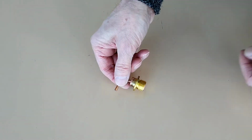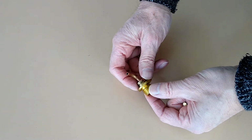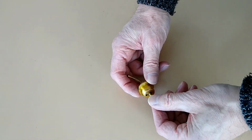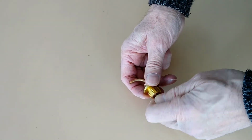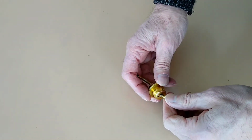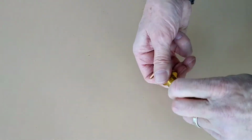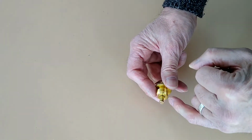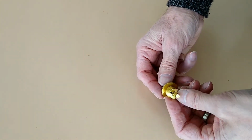Okay, so I've soldered the tube into the first part of the body. And I just thought I'd show you the stem that's come out of there. You can see it's screwed in. So what I do now is I just give that a good clean, and then with a little bit of flux on the thread, I do it up till it stops, and then I just back it off about a turn, and then I solder that in. Just gives me a little bit of a gap there for the solder to wet into.